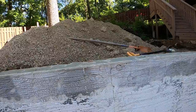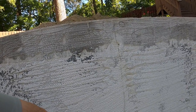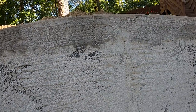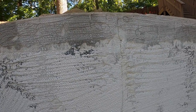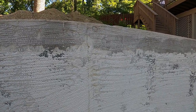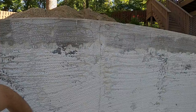There are probably a lot of different ways people may go about trying to repair a crack in a pool. A common way is to do an epoxy injection — a lot of people call it an injection, even though many times they're kind of just pasting it over the crack. They also make different types of staple products, some described as being Kevlar or other materials. There's a product called Torque Lock that is a steel structural staple allowing you to apply torqued pressure to hold the crack together. That's the product I'm choosing to use.